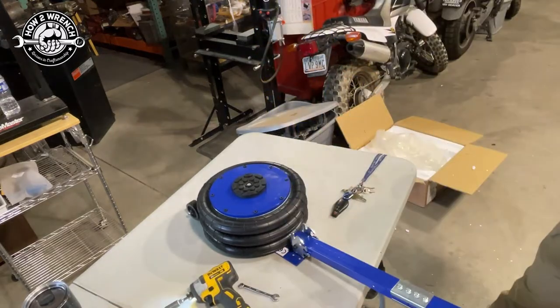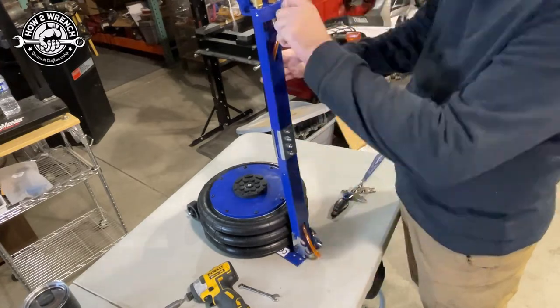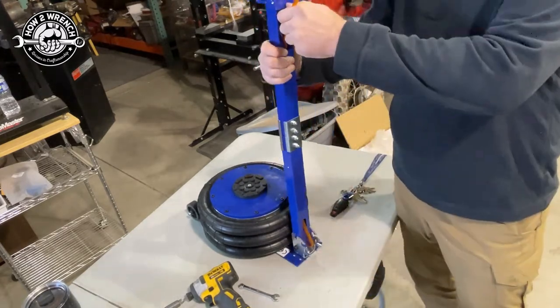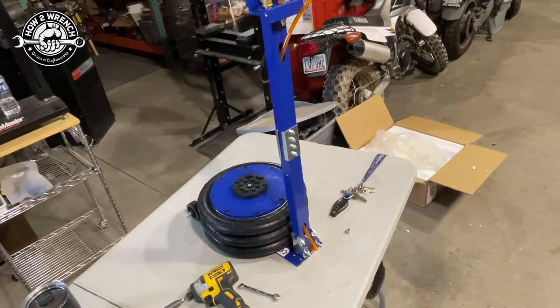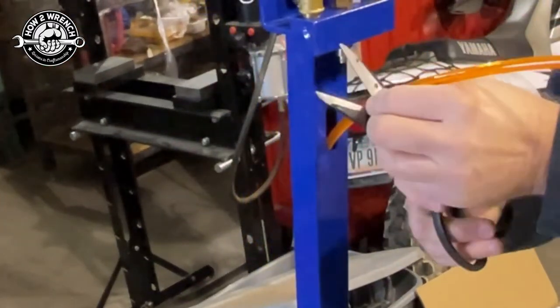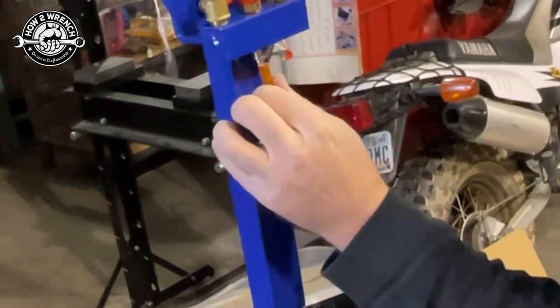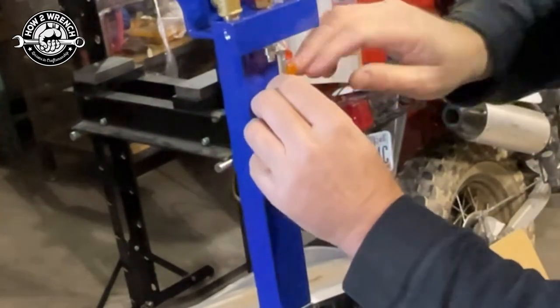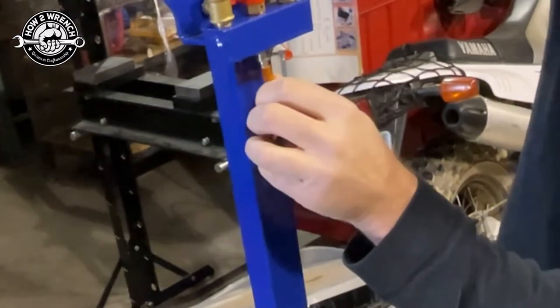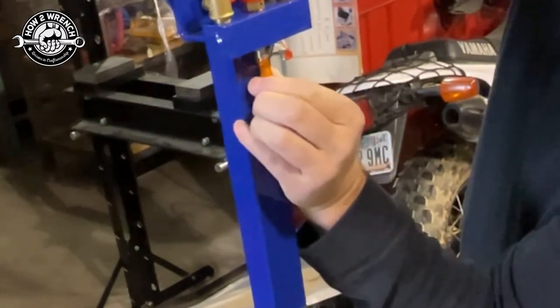Next, decide how long you want the hose — run the handle through its full travel and you'll see there's a pinch point on the bottom. I really appreciate that they give us the choice to cut it ourselves rather than having it be too short. Work it through a couple times, cut it off, then slip the nut over the hose — don't let it fall down inside the handle — put the hose on the nipple and tighten it up with a wrench. It's just a simple hose compression fitting.